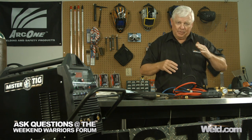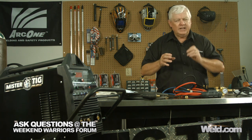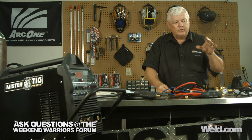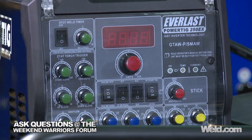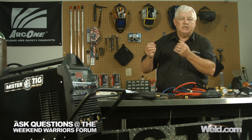This machine is a 250 amp machine, AC/DC. It lights off at 5 amps on both AC and DC — the plus or minus tolerance on that is 2 amps. If you really want to get down to the true 5 amps, you've got to drop down to the 0.040 diameter tungsten. So if you're doing foil-type work, use the 0.040. There's pulsing on here up to 500 hertz. There's also a hertz setting to squeeze down your arc for welding aluminum — it goes up to 250 hertz, and the higher the number, the tighter the arc gets. It's an easy-to-use, analog machine — we decided to go analog instead of digital. It's easier to teach, easier to look at, and easier to set up.